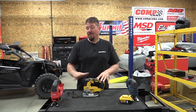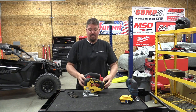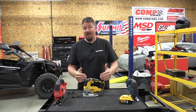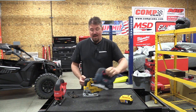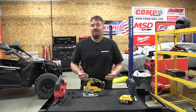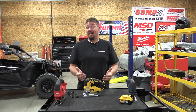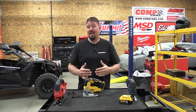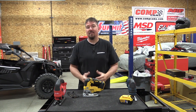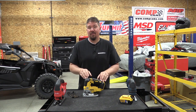If you're looking for something a little more compact — especially compared to some of the newer larger models — and want to get into tighter spaces, this is going to do it right in the same manner as the Bosch, and it's also going to give you great run time with the brushless motor. If you're looking for dust collection, this model does not have it; it might come in a larger model or you may have to go back a few models to get it. Either way, this is a cool little jigsaw if you're looking for one.